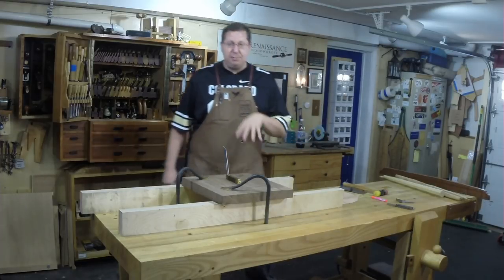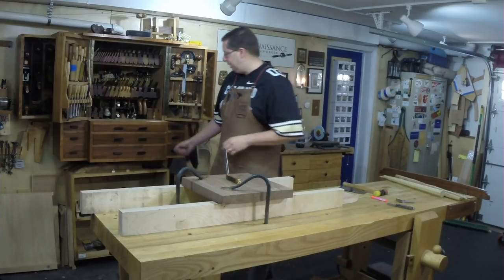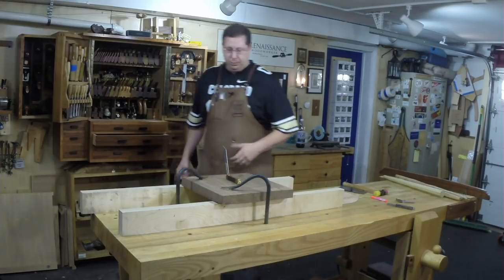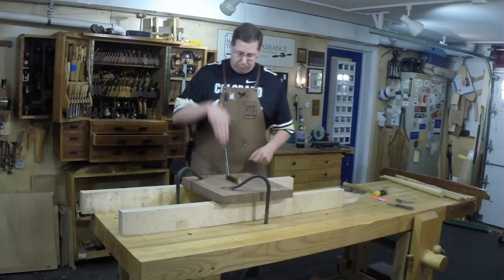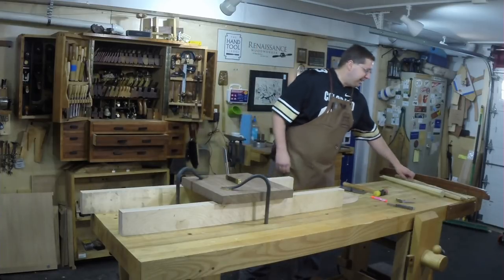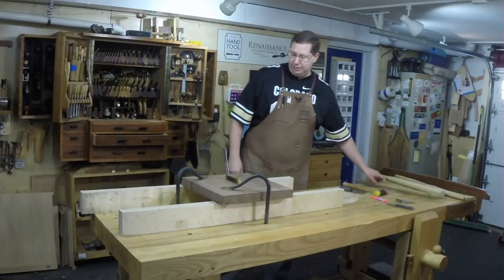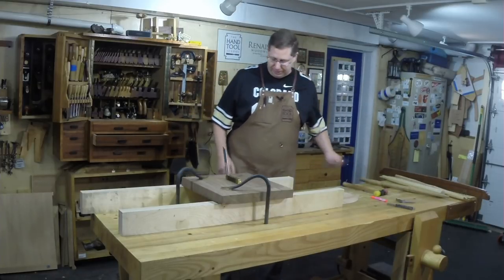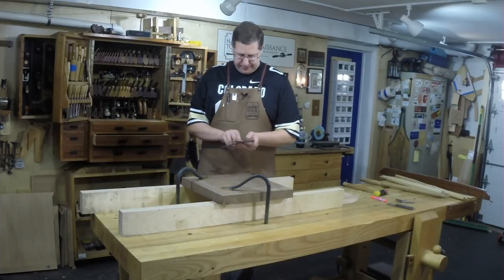I'm going to be boring from the top down. So it's important to do a gut check here and think about which way I have to bore. So I've got 22 degrees set up, right? Well, if I bore along this angle from the top, now instead of the leg splaying out like it should, it's going to splay in, and then we're going to have a real nasty balancing thing. So I think I'm going to go ahead and reset this